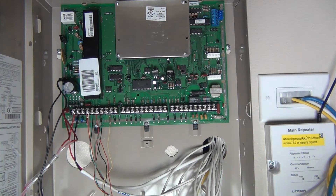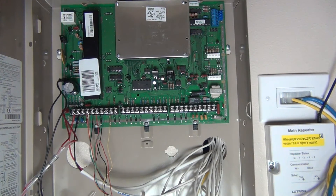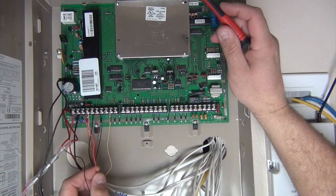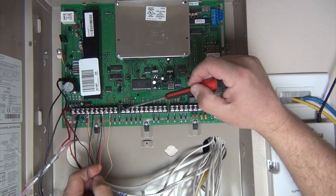At this point it's time — no more messing around. You need to know exactly how your zones are going to lay out: which zones will have shared devices, which zones will be your main entrance, where your motion detectors go. I like to make zone one my main entrance. If I exit my house, turn on my alarm, and come back through the front door, I don't want the alarm to go off immediately — I want a countdown of 30, 60, or 15 seconds to disarm it. So zone one is always my primary entrance or exit. Terminals 10 and 11 are also used for smoke detectors and will serve zone one.